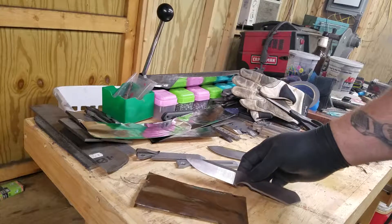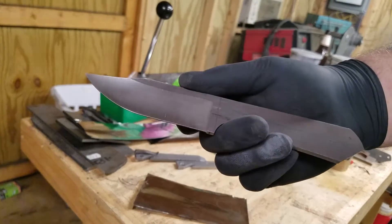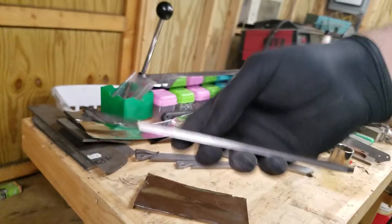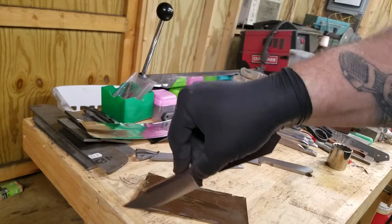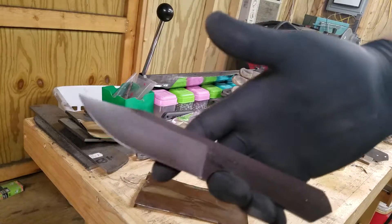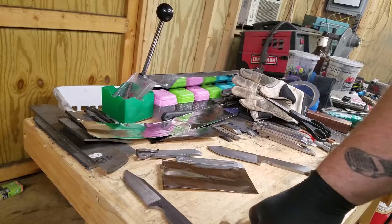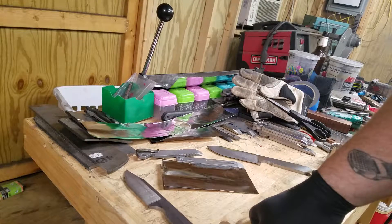The last one I did — BG-42 is an oil quench stainless — it reacts much like carbon steel, except you get it up to 2,000 degrees, hold it at soak time, pull it out straight down in the oil, and there it is. This one did get a little color on it from quenching. I think this next time I'm going to try quenching it in the foil pack — I've heard a lot of people say that works just fine.